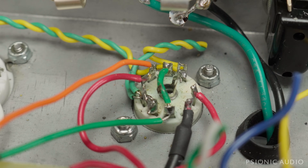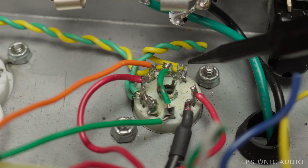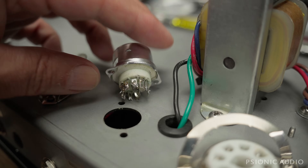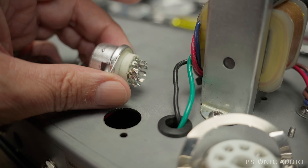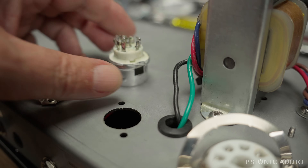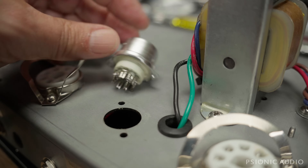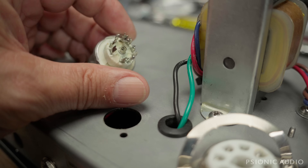Now that I have worked with these Weber ceramics, I wish I'd replaced all of them with Beltons. It would be faster to just replace and redo everything from scratch than to reuse these, but I was trying to save them a little bit of money. It's just not a very pleasant socket to work with, but I'll make it work. Those Novals have got to go. This is frustrating — I know that I ordered a whole bunch of Belton Noval tube sockets with shield bases, and I cannot for the life of me find them right now. As I record this, it's late afternoon before Labor Day, so it'll be Tuesday before I can swing out to Tube Depot and pick up some more. But I'm going to heed the calendar and listen to my body, which says it's done for the day. I've been pushing myself to get this much done, and it's a pretty good length to reach for a video.